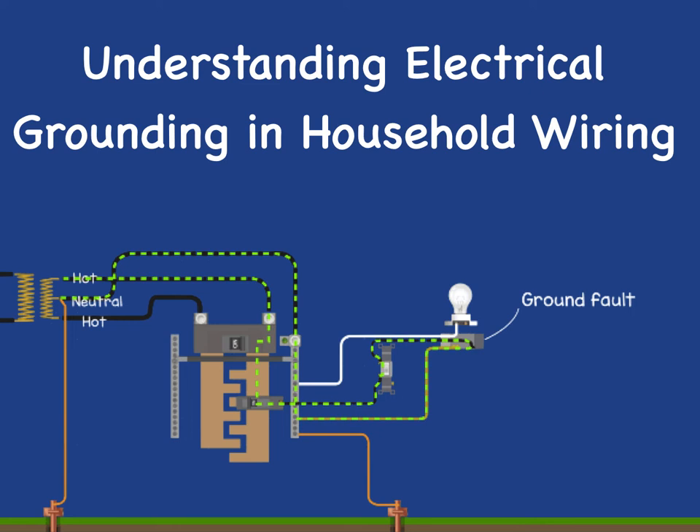A short circuit is when electricity strays outside the wires that it is supposed to flow through — in other words, when it takes a shorter path. To prevent this danger, your home's electrical system includes a backup plan: a system of grounding wires that runs parallel to the hot and neutral wires. It provides an alternate pathway for electrical current to follow should there be a breakdown in the system. If a wire connection becomes loose, or a rodent gnaws through a wire, the grounding system channels the stray current back to ground by this alternate pathway before it can cause a fire or shock.